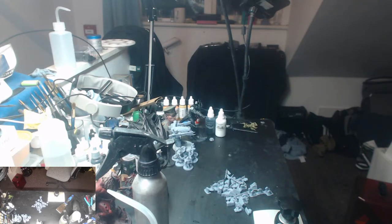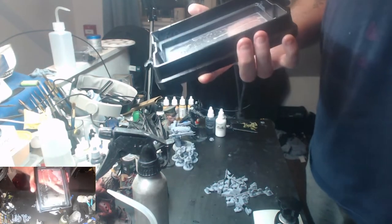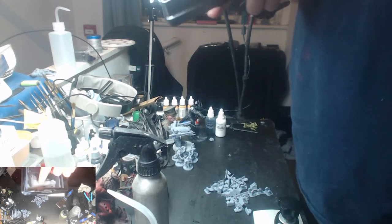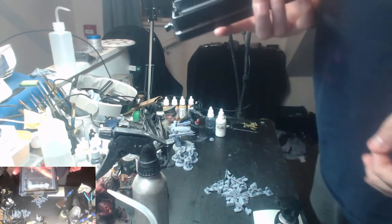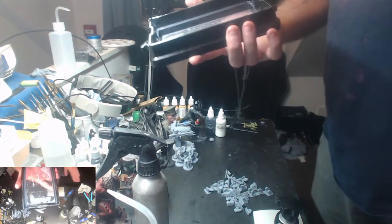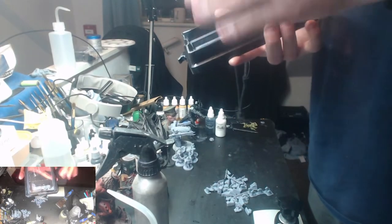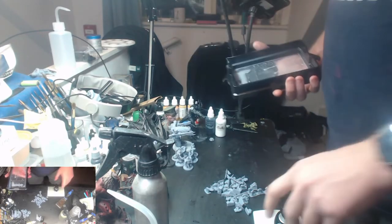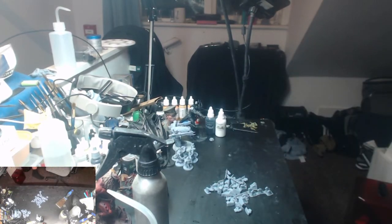Now, you're going to see, I'll use this overhead. You're going to see what I'm talking about. This is a damaged screen. The screen itself is what's projecting this print. It's not the model, it's not the files, because this happens on every print. It is the screen itself that's damaged. Now also bear in mind that this FEP sheet needs to be replaced soon, because it's webbing. A webbing sheet is not a good thing. So what I mean by that is, you'll see why here in a few minutes.